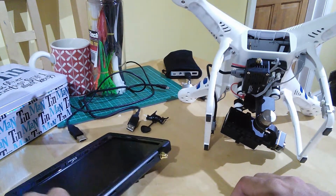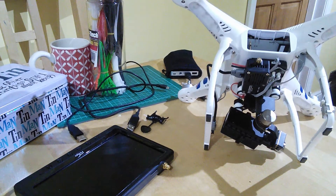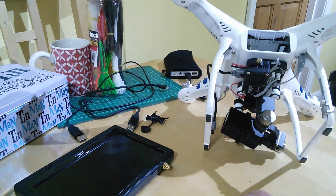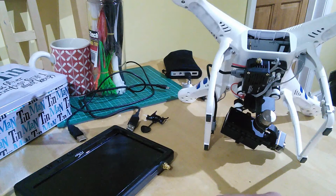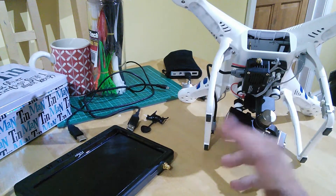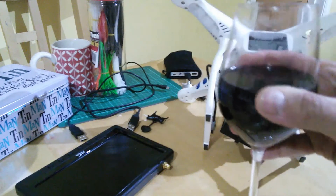So that's a quick explanation of the difference and what each type looks like. Hopefully if you're now looking for antennas from third-party manufacturers — such as Horizon FPV, FPVLR, or any of the others — you'll now know whether you've got an RP SMA (a 'really pointy' SMA) or a standard SMA, and which matched antenna to go for. I hope that was useful. Thanks very much for watching and we'll see you again soon on the kitchen table. Cheers.